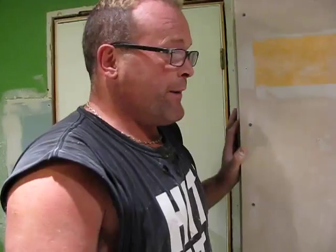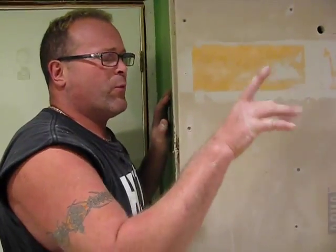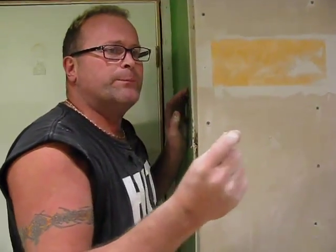So behind all that tile, that's what we did for the prep. It probably took me about half an hour to do that prep, but to me, it's well worth it, because it just gives me peace of mind. Like the tile work, right off the bat, the existing tile, if you remember, was probably 4x4 or 6x6 ceramic tile, 30 years old, thin. So right away, with a smaller tile like that in a high moisture area, you've got a lot of grout lines. As well as a lot of grout lines, the tile itself was 3/16 of an inch thick at best. So every grout line in there, and there's lots of them, is 3/16 of an inch thick with grout.